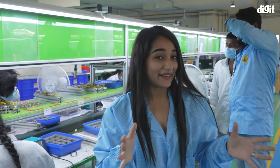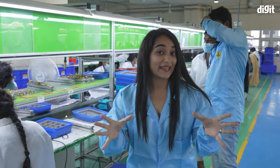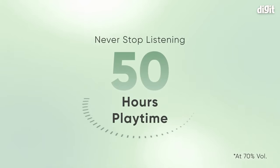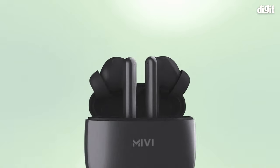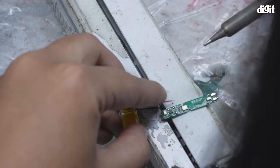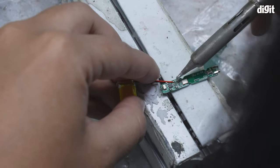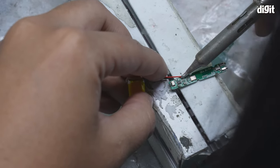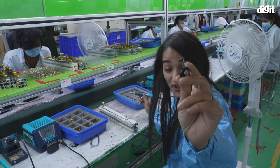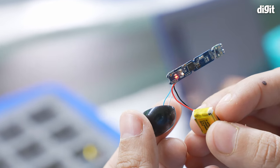I'm going to start a very interesting process in making a TWS earbud, and that is putting in the power. The MiWi Duopods F70 have a 40mAh battery in each earbud — you can see it right here — and that is what I'm going to be placing onto the IC. Now that I've soldered on the battery, I'm going to be soldering on the cavity with the driver inside.